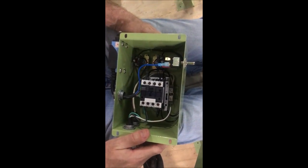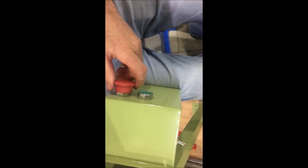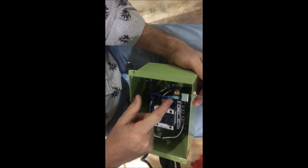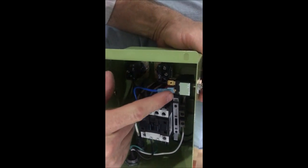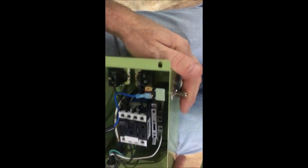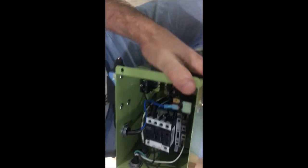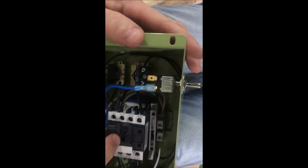This is the control box on the saw. Basically what we have here: you've got your e-stop button — e-stop off, e-stop on — your start button, your hood switch, and your toggle on and toggle off. The toggle should be mounted where the terminals are at the back. If by chance it got turned around then it would work opposite — it shouldn't be mounted any other way. When the chain is pulling, it pulls it off, so those are the controls.